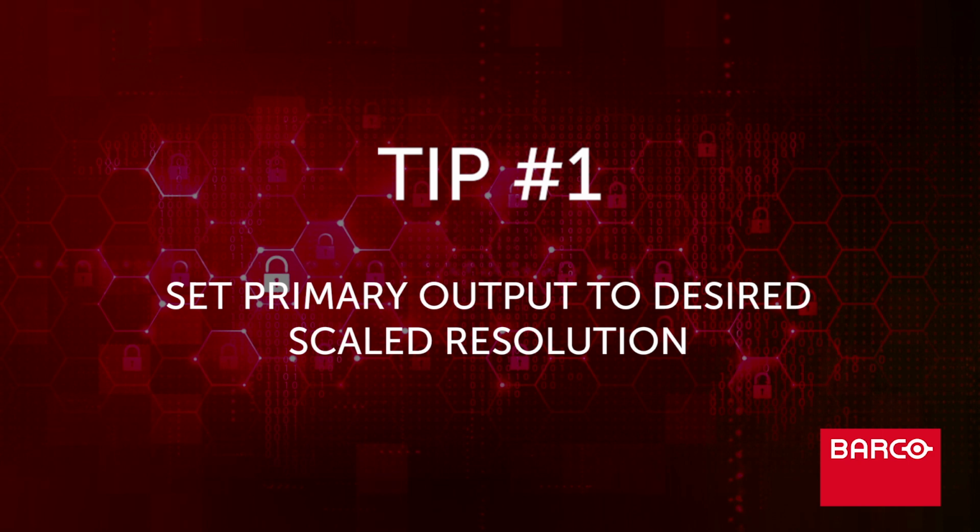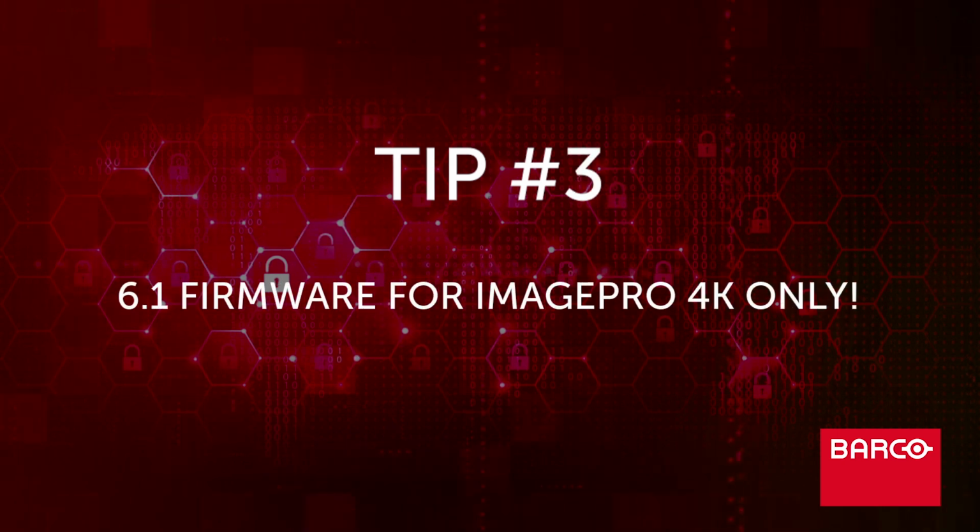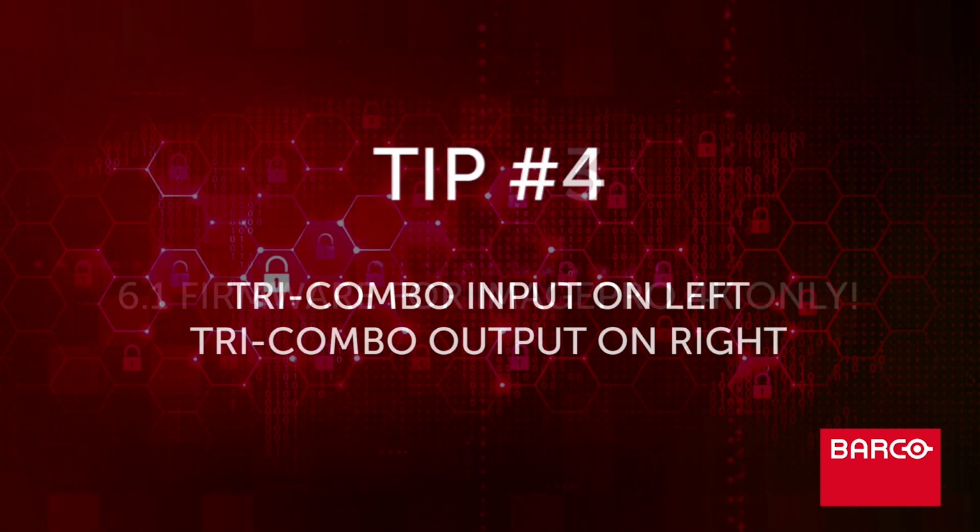Set your primary output connector based upon the resolution you'd like to scale to, for example, VESA or SMPTE rates. Any still designated as a logo will not be scaled. EventMaster firmware version 6.1 is only for the ImagePro 4K and should not be installed on any other EventMaster processors. ImagePro 4K currently only supports tri-combo input and tri-combo output cards. These cards must be installed with the input on the left side and output on the right.